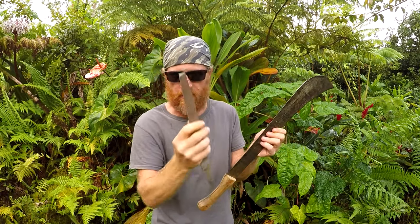Make sure the file is the type that's meant to sharpen things like lawnmower blades or a machete. You can use the bastard file to put an edge on your machete — that's the file that has grooves criss-crossing and it's meant to take a lot of material away. If you do have chips in your machete or there's some significant damage, you want to use that type of file to get the edge back, and then this file will just sharpen it and clean it up.